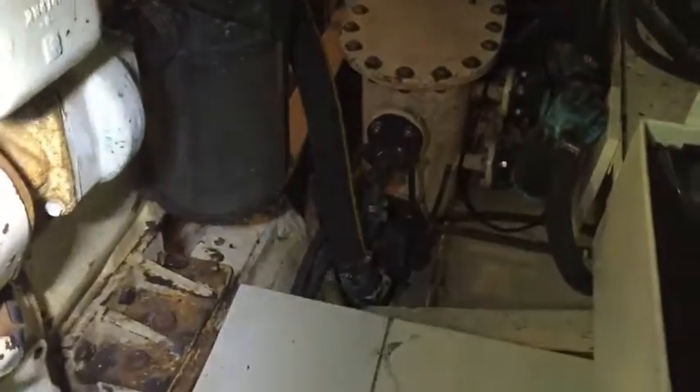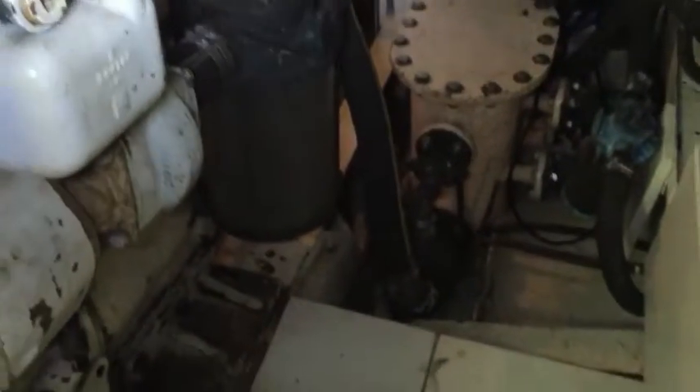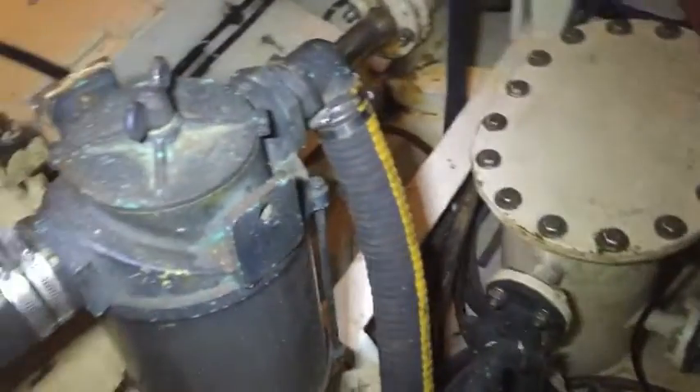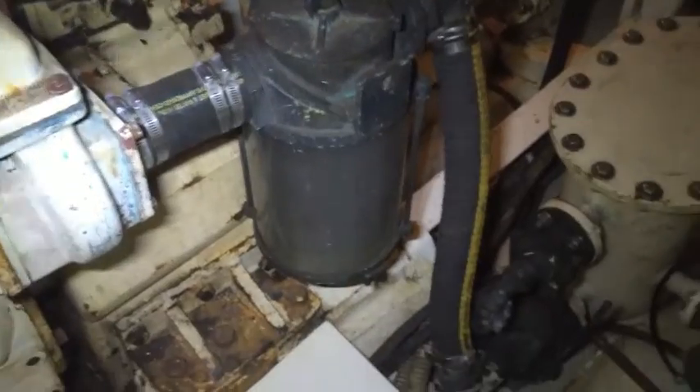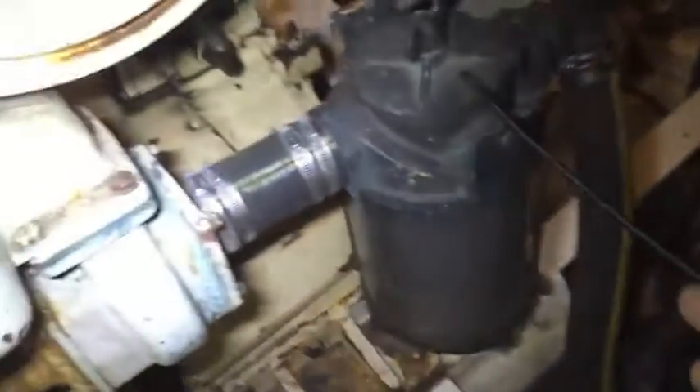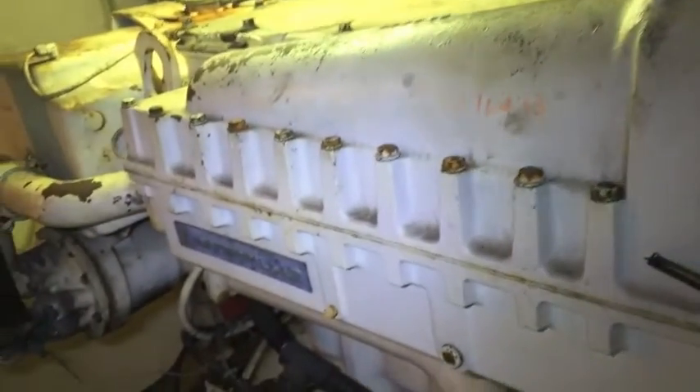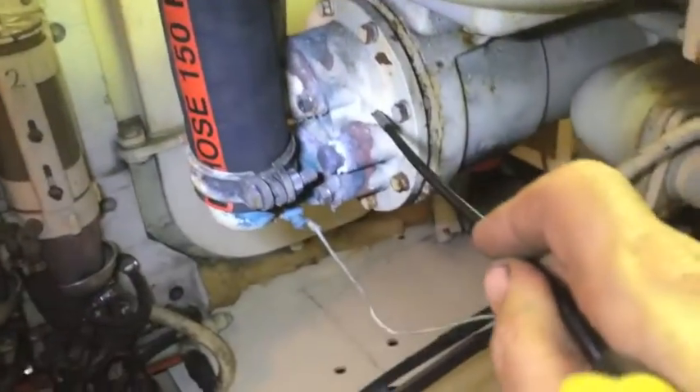Quick tour of my Marine Caterpillar D343AT. I'll get the flashlight so you can see everything — it gets a little dark in here. I'll start off with the stuff that I know is different, which is obviously the raw water cooling instead of a radiator. Boats have raw water cooling from whatever they're floating in. Water sucks in from here, comes through a strainer, through a raw water pump in the back, up into the pressurized air off the turbo after-cooler. Then the cool outside water comes back into a heat exchanger and back out overboard. That's the raw water circuit.